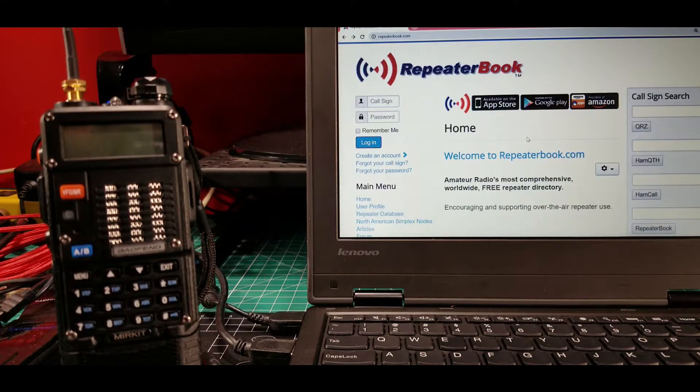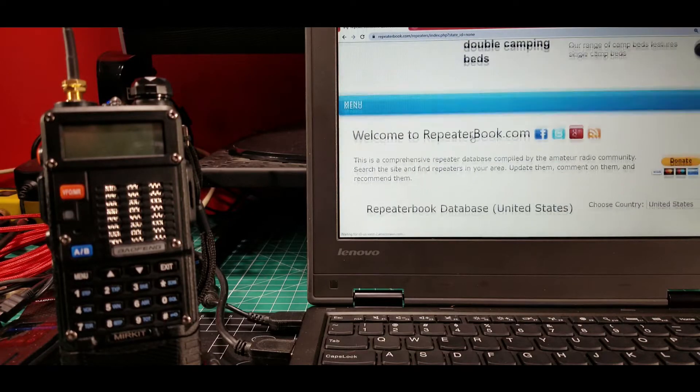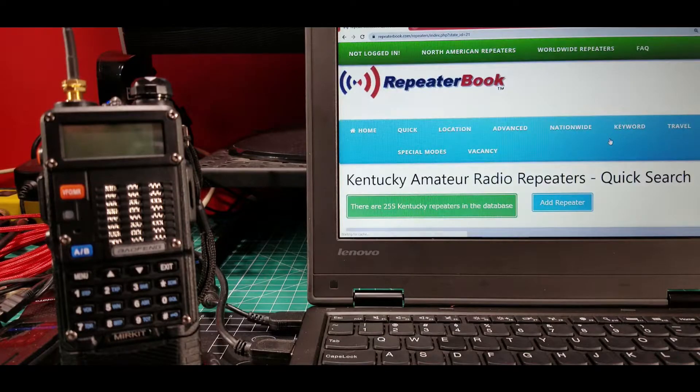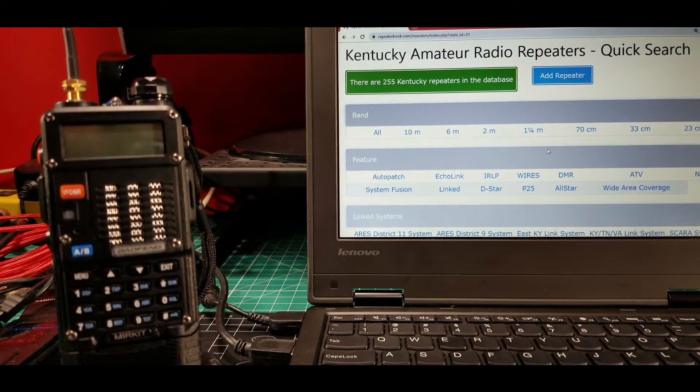You can just put in your location. Under the directory section, North American repeaters — let's click there. I live in Kentucky, so we'll click on Kentucky. It's going to bring up different frequencies. They even have stuff covering digital modes. Let's take a look at a pretty common frequency for handy talkies — two meters. A lot of these handy talkies are dual band, doing two meters and 70 centimeters. Two meters tends to be pretty busy, so that gives us a high chance of success.